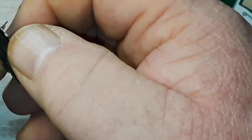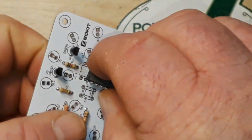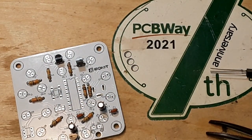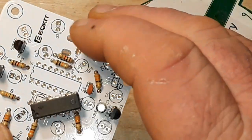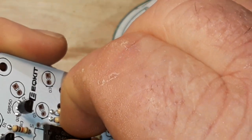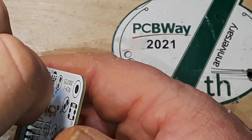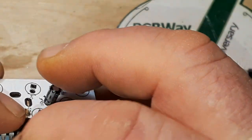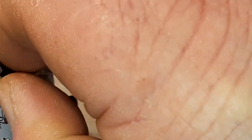All right, let's put our IC in here — and you won't believe it — it's a CD4017. Well, here's what I find interesting: where's our clock source to drive it? So maybe there's some sort of oscillator built out of those transistors, which I thought were being used to switch the loads — but if they're not, that's interesting. There we go.